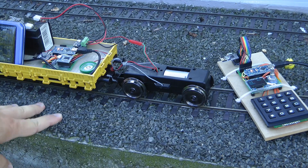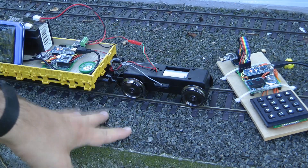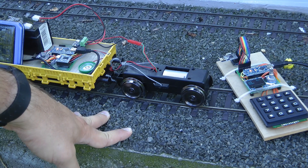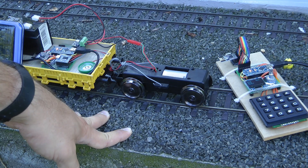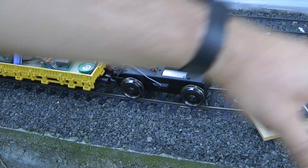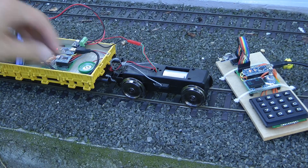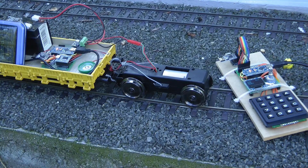This is a very early prototype — more like a proof of concept — just to make sure that I can build this from kits that are readily available on eBay and the usual Chinese sources, and just to make sure I can code it and it works. But still there is a lot to do. For example, the power supply part is not really thought through, so that's why I have two power banks running each of them. That was just the easiest way to plug it into the USB port of the Arduino and power it from five volts. But I would say that most of the other things are final.